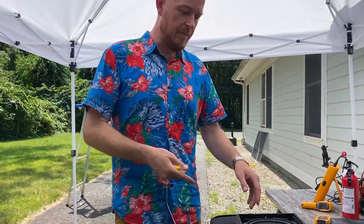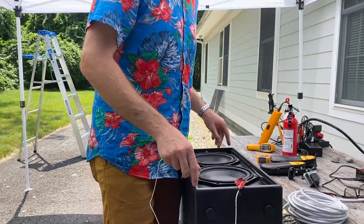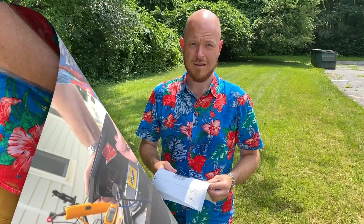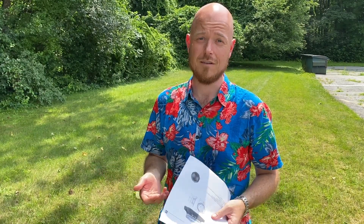So we're going to try and set limiters for this subwoofer, which is a two-by-eight with a port. To do that it's really nice to know how hot the woofers get, so I'm going to put a thermocouple in there and tape it to the woofer through the port. This is the guess-and-check method we're going to use today, and I think it's actually the most effective and relatively foolproof way to do this — if you can afford to possibly launch a woofer, which means you buy more woofers, so that's a good idea, right.